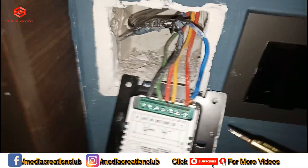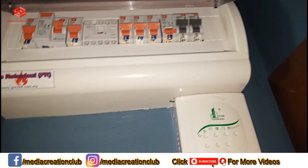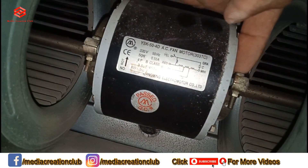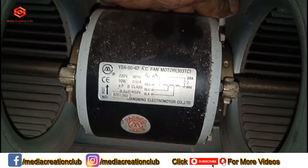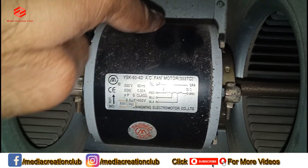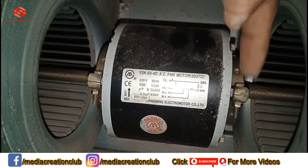Since bypassing the thermostat didn't help, it means there is something wrong with the blower itself. We turn off the supply first. Now we go and open the FCU fan blower. You can see the blower here. We loosen these two screws to move the fan to the side, and then we check the capacitor — is the capacitor working or not? Because the blower, as you can see, if I move it by hand, the fan is not jammed. We need to check the capacitor before opening the blower further.